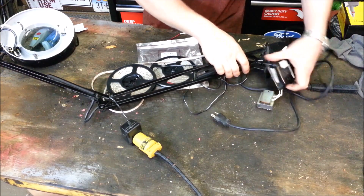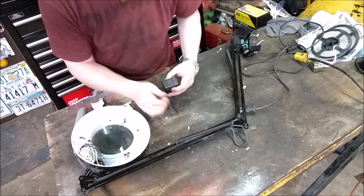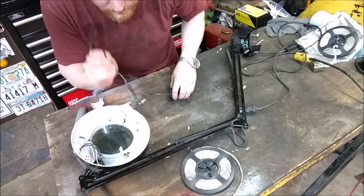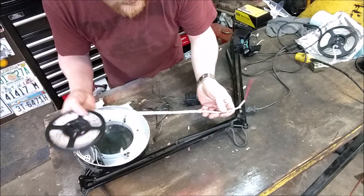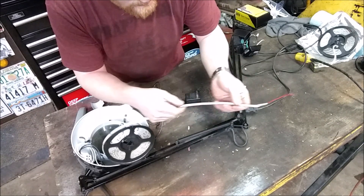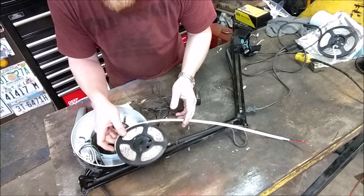I have no idea if it works — it might, might not. There's a plug back here that I'll probably still leave on and utilize; this light fixture has a standard plug on it. All we need is to have power come up to here, then I can cut the connector off and solder the wires directly to the strip lighting through the light switch. The nice thing about this LED strip lighting is you can cut it anywhere — there are little cut spots throughout — so even though they give you wires on the very end, I'll just cut off chunks and solder. They give you little terminals; you can just solder your own wherever you want.